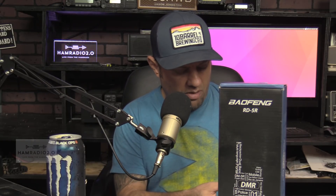This model is the RD-5R, which you can see right there. And I know what you're thinking — it's a Baofeng, so it can't be any good. There's some truth to that. In the past there was some truth to that because they did a model called a DM-5R a while back that was released by Radioddity that was single time slot, upgradable to dual time slot. I was suspect of that when it first came out — that's going to require hardware change. You can't do that in firmware, and sure enough, it failed.